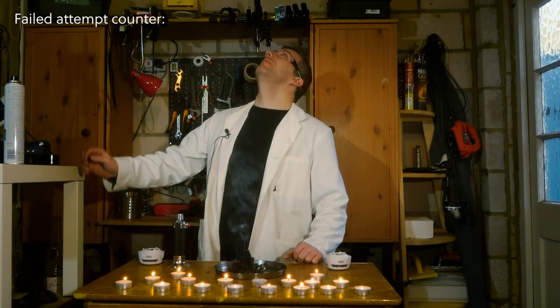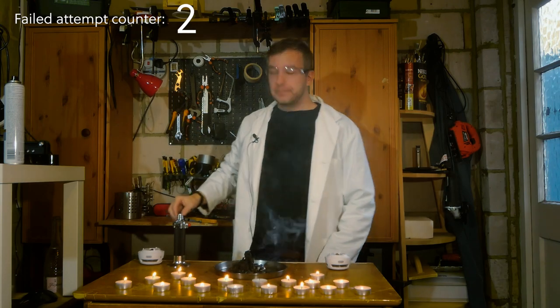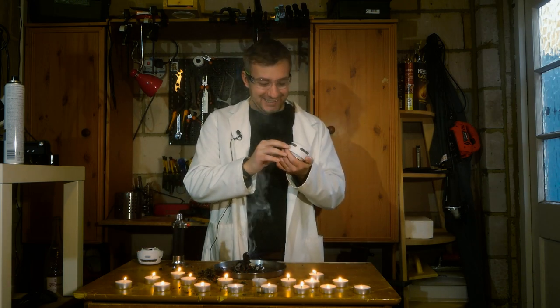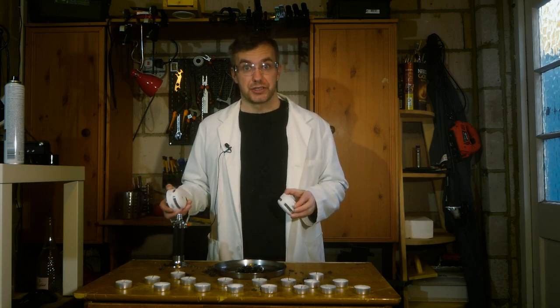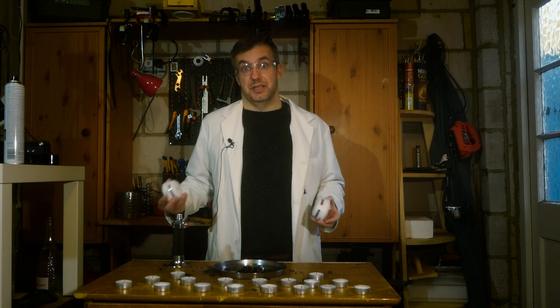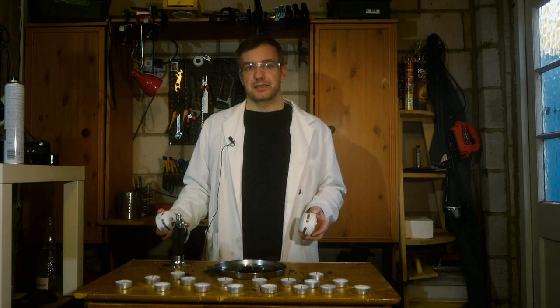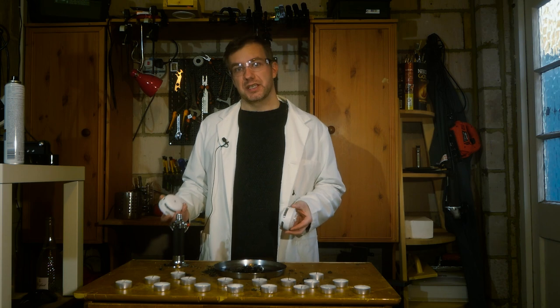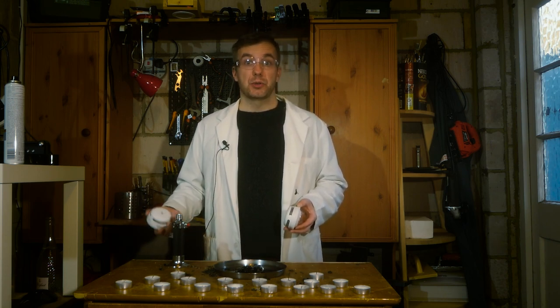All of them triggered. If the alarm is triggered by one of these devices, all you have to do is press the silent alarm button. If you press it on the device that triggered the alarm, it will silence all of them. However, if you press the silent alarm on any of the linked devices, you will only silence those linked devices, leaving the main alarm that detected the smoke operational with the siren still running until you go there and deactivate it. The cooldown period is nine minutes — if you press the button on that unit, it will be in stand-down mode and resume normal smoke detection after nine minutes.